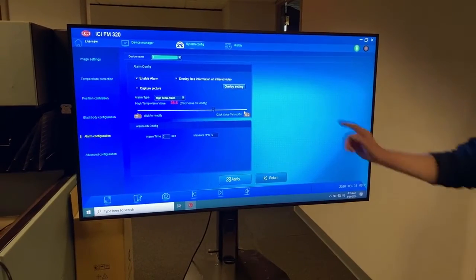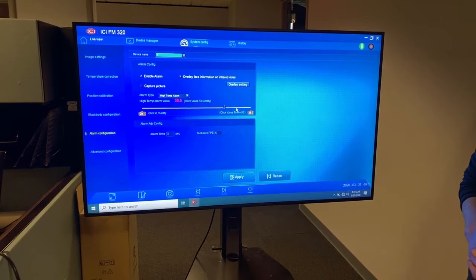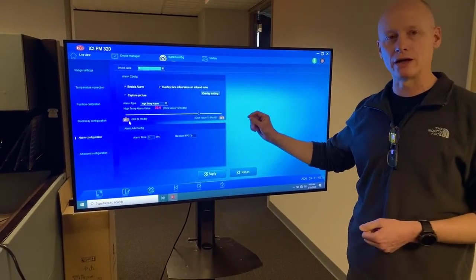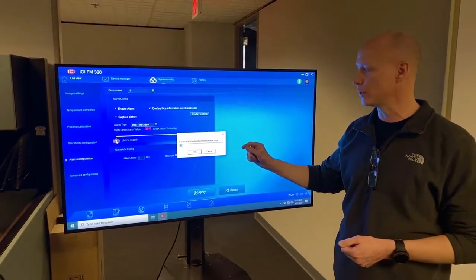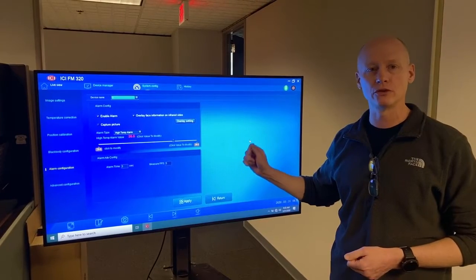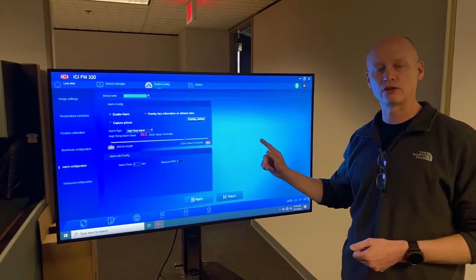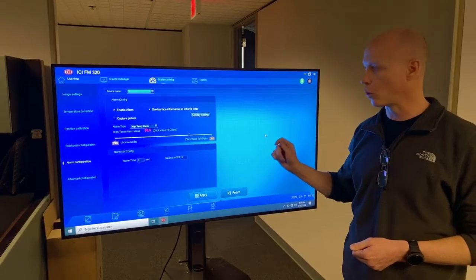And then we're going to come down here and set this at 39C. And we're going to reiterate this as well, but one thing, all adjustments to these alarming values have to be done in degrees centigrade. We're going to show you in the configuration screen in just a moment where to change that, but this has to be done in centigrade. You cannot do this in Fahrenheit. 36.5 is the equivalent of 97.7 degrees. That's a skin surface temperature. That temperature is about 1.4 to 2 degrees cooler than our body core temperature.